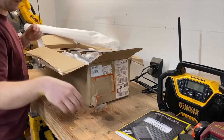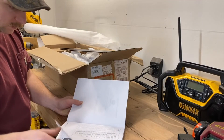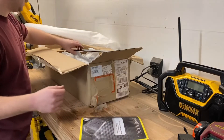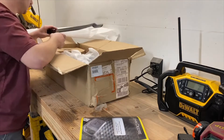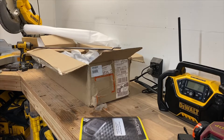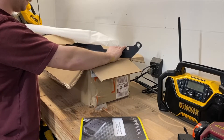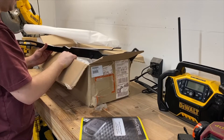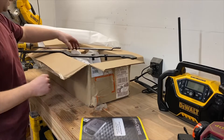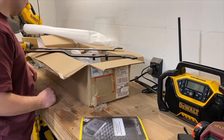This looks like the main lift bar that we use after relocating a hydraulic link — the strapped lift. I want to compare this to the one from the X580. This is the lift link from the X580, doing all the lifting from the front where the mower deck attaches, and at the back end is where it pulls on the rock shaft of the sleeve hitch. I would have thought that link for the 700 series would have been at least this thick or thicker. Obviously, it's not. It's a little bit worrying.